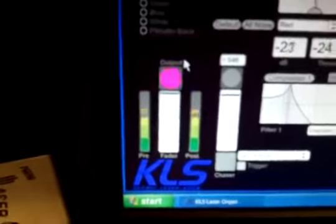If your pre-fader is set to a good level like this one is, you can leave that at full, and then your post fader is at unity gain or equal to your pre-fader. And we can see that the output section here, the LED is blinking accordingly, and in kind is the front LED output on the laser organ interface. Also, the white audio LED is blinking according to the audio trigger. So that is the input stage.